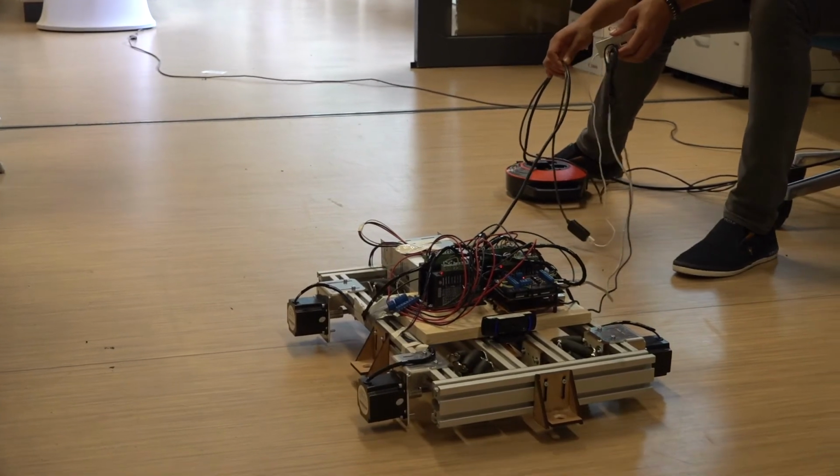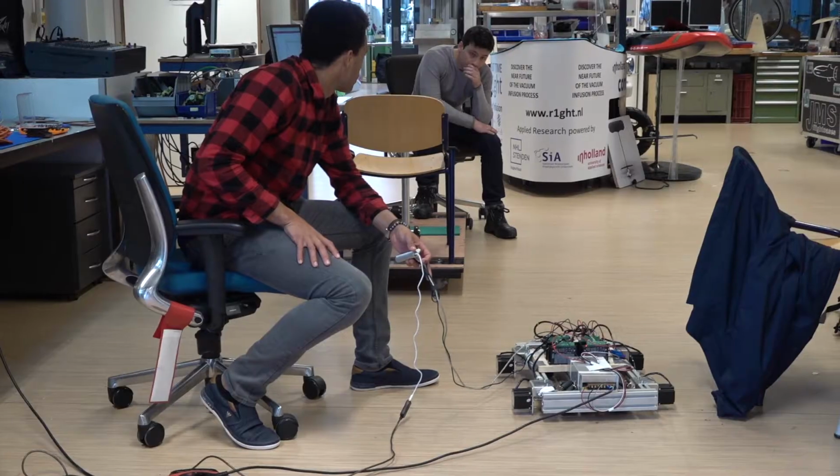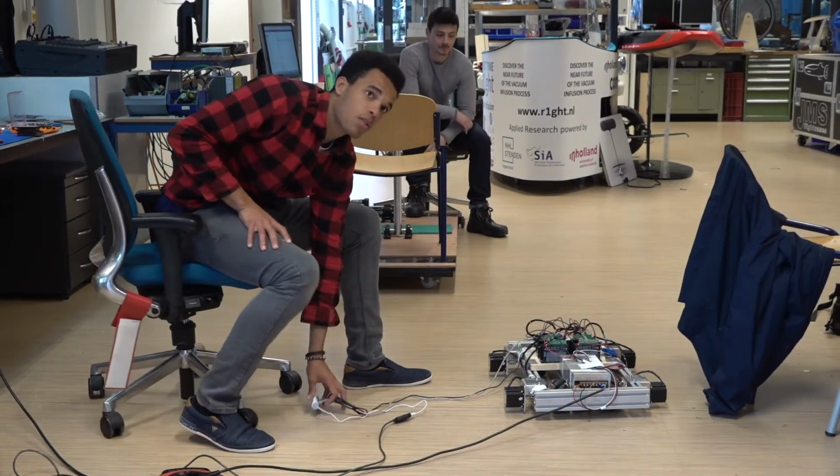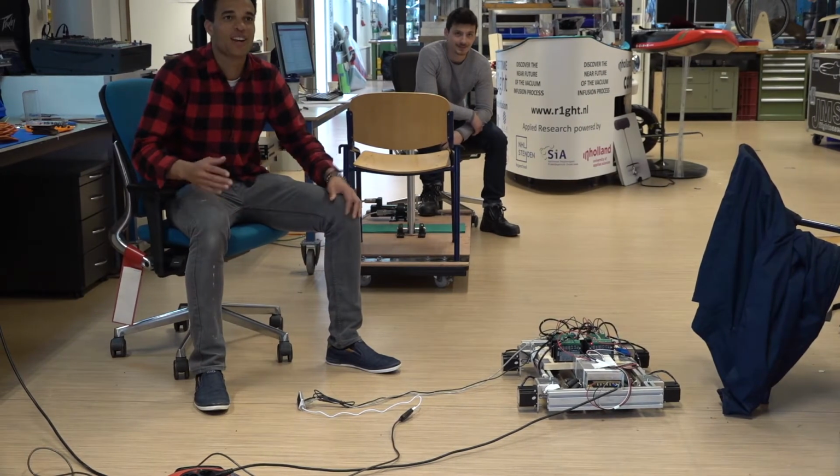To go along with the mecanum wheels, I chose suction cups. However, there remains a problem: suction cups resist shear, which is unwanted since we also want to locomote. To solve this problem, I added a small ring of Teflon to the bottom lip of the suction cup. This allows the suction cup to retain a normal pulling force that keeps the robot against the surface of the wind turbine blade, but allows for low resistance to shear force, which allows the mecanum wheels to locomote the robot.